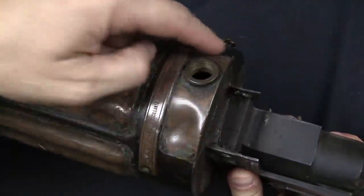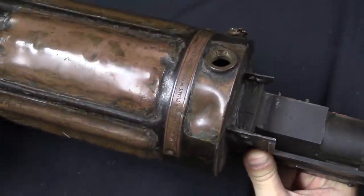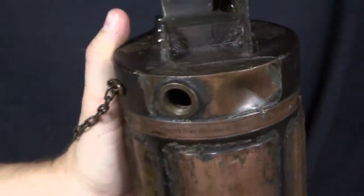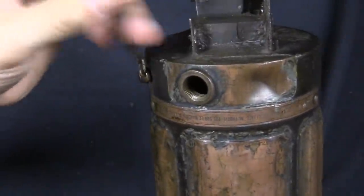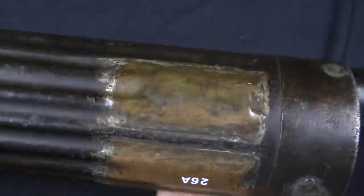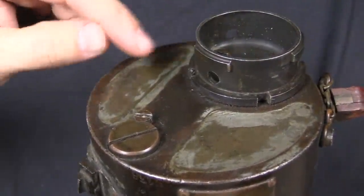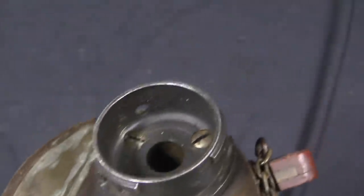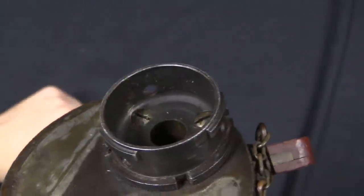On the air-cooled guns the rear section was removed because you just wanted more airflow through. Of course they didn't need the fill plug because they weren't filling them with water, so another big brass section has been patched in there, including adding in a threaded plug so that there was a fill plug. The actual plug that went in there is missing, but we still have the chain from it. They did the same thing with patches at the front, all the way around. They never did cut out the bottom because the bottom of these guns were basically sitting on top of the aircraft. The aircraft guns also had these big holes cut in the front of the jacket to get more airflow through, so those had to be patched up as well. The booster here has been very permanently and thoroughly screwed in place so it can't come out.